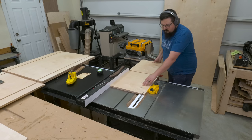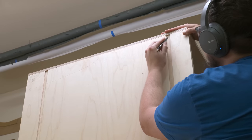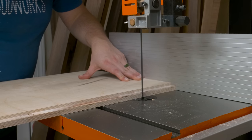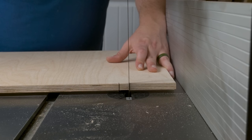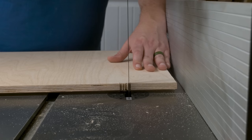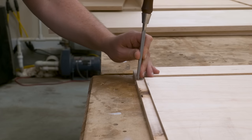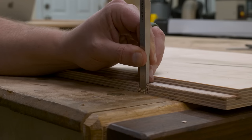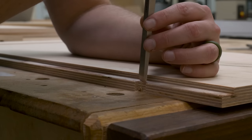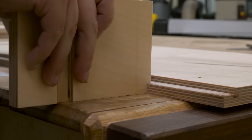The last horizontal piece to cut is the lower shelf that goes below the drawers, and I'll mark that out and cut it to width based off my dado placement. From there, I need to take two notches out of my rabbet, because the shelf runs the full width of the cabinet. If I didn't do this, I'd have to cut stop dados, and cutting these notches is just a lot easier — plus they'll be concealed by the edge banding, so you'll never really know they're there. To cut those, I notched them out first over at the bandsaw, taking some small bites to create relief cuts. Then I took the piece over to my old bench and knocked out those reliefs using some chisels with light taps from a mallet. Once I felt like I had a nice fit, I grabbed another scrap piece and tested everything out.